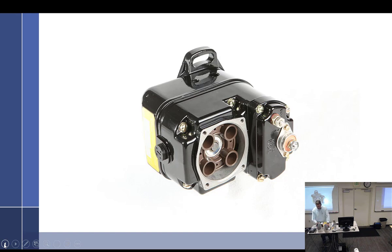Well, it used to be kind of that's the way it was. You either had two of these, either Bendix or Slick. Those are the two flavors they come in. No other flavors. Bendix or Slick, you have two of them. Or you had the dual magneto. This is a D2000. Now they have the D3000. That is an AD, says you can't use it anymore because it has a magnesium case. The magnesium, it burns real well. It warped. And when it warped, it locked up the shaft. And when it locked up the shaft, it doesn't work.